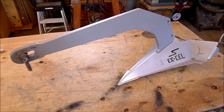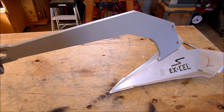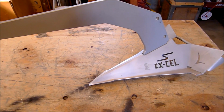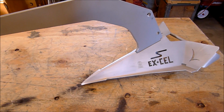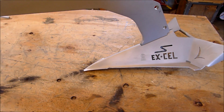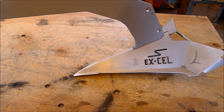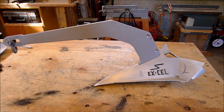I've decided to investigate further the resetting capability of this Aluminum Sarca Excel number 5. If you recall from the previous video, the anchor had a little trouble at times with my 180-degree wind or current reversal test. About half the time or so, the anchor dragged considerably and only reset once the boat speed was reduced down to, say, a knot or a knot and a half.